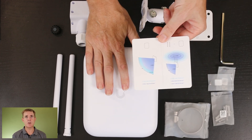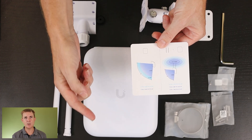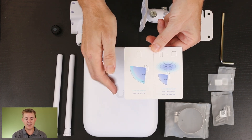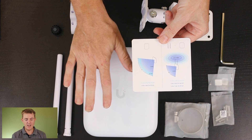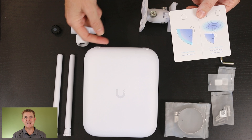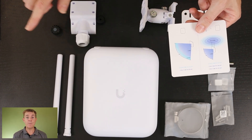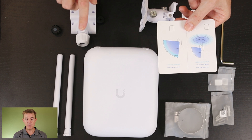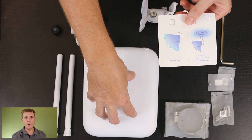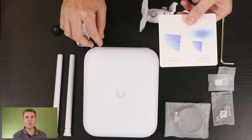Out of the box you can run it without the antennas on — I'll show you with the antennas on in a moment. It's a directional unit; you get about 90 degrees by 90 degrees, though I think one of them may be about 45 degrees in five gigahertz. When you add the antennas on, it gives you 360 degrees from the antennas in the surrounding space as well as still giving you directional coverage from the front. The six gigahertz is only available directional here, not from the Omni antennas.